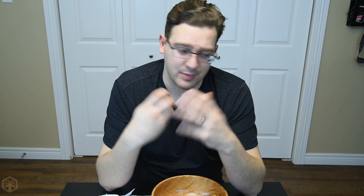One thing as well — with your rags, you want to either soak these and wash out the oil as best you can and then put it in the garbage, or leave them flat out to dry. The reason I say that is because oil-soaked rags like this can actually cause fires if they're bunched up. There's a number of times when people have bunched them up, thrown them in the garbage, and they've actually combusted overnight and people lost their shops. So when you're using this, even though it's not particularly flammable, you want to make sure you take your towels, lay them out, let them completely dry, and leave them somewhere where if they do catch on fire they're not going to burn everything around them — like on a metal bench or outside on a gravel surface. Leave them overnight, or wash them out and then throw them away. Make sure you do that — it's really important not to leave these bunched up in the garbage can.